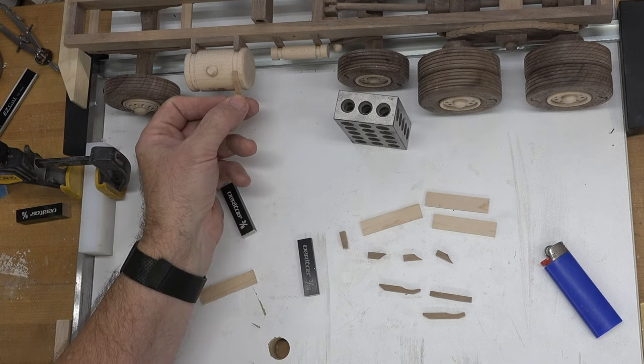The last thing that we need to do is make the top, and then I'll show you how it all goes together. And that's this piece right here. It's a simple matter of following the dimensions here, guys. 8.5 degree angles on the sides. However, this piece right here, the back angles, front and back, it's kind of a tricky piece. So what we're going to do is we're going to cut these angles here first. They are 6.5 degrees. We will cut that from an oversized piece. It's 4 1/4 inches long.